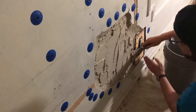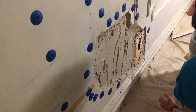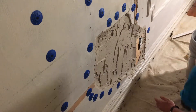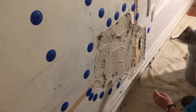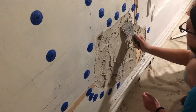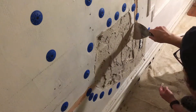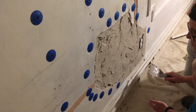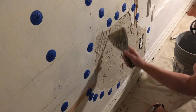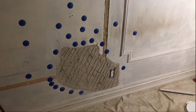That little plywood area is holding the laths in place for a new electrical box in the wall — I am slowly rewiring the house. Here I am adding more of the scratch coat, trying to get it up to a reasonable level so I don't have to use too much pure plaster for a skim coat or finish coat. The mix is slipperier and thinner than peanut butter, but not too much, because you don't want it to sag and run off the wall — you want it to stick. Alternate adding water and adding plaster until you feel like it's something you can work with. I'm trying to leave it a little bit indented so I don't have any funky sandy lines, and this is why we call it a scratch coat — I scratched some lines in so the finish coat has a little more to adhere to.